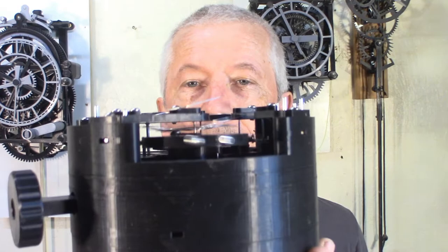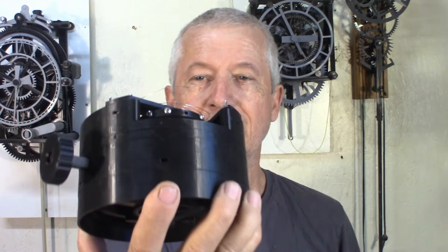Also, another change with that spring: I have better clearance between the top bridge and the balance wheel. So now I can really go in any position. It still keeps working, unless I go too fast. And then that's another story.